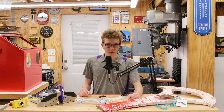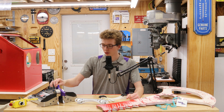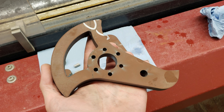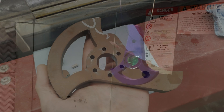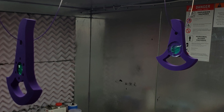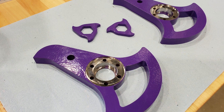While the weapon on Kaleidoscope V2 looks a bit different than the last one, at its core the weapon system is the same. This new weapon is made from AR-600, available on recr.us, and is powder-coated as well. The new design gives it a little bit better aerodynamics, it's lighter weight, and gives it more energy storage — just overall a more mature design than the bar that we ran last time.